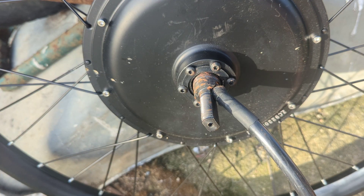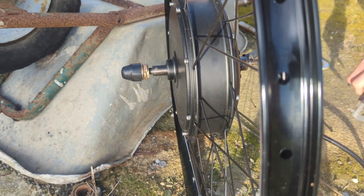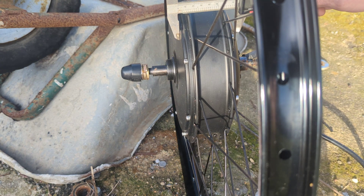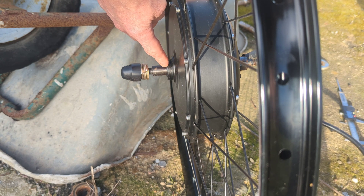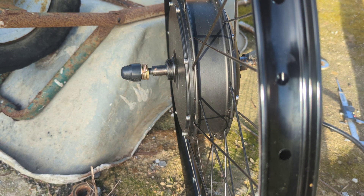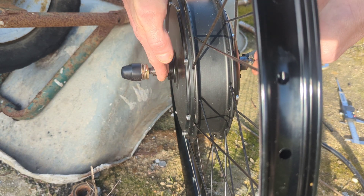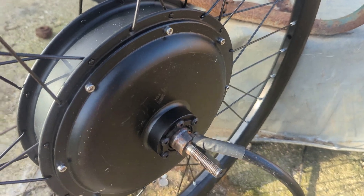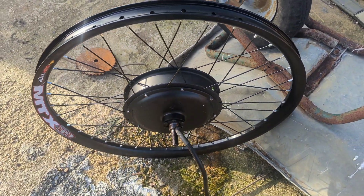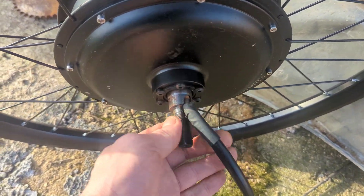With regards to the existing frame of the wind turbine, I'm not sure it's big enough — I'll show you why. This motor is actually pretty wide, around 75mm. The distance between the two bolts means we need a clear 150mm space to fit this in. That thing is a beast, but hopefully there's a way around this problem.